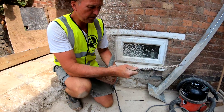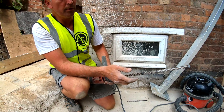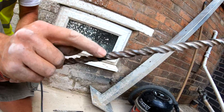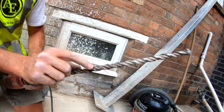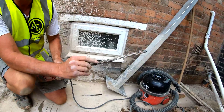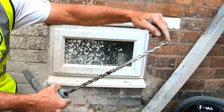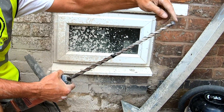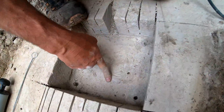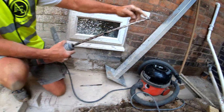The reason I'm using 14mm is because that's what's been specified by the engineer, and it matches the size of the bolt we're using. I've also put a bit of black tape on the drill — that represents the depth from the top of my footing down to the full depth I need to drill. The engineer has specified we need to be 110mm down into the concrete, so with the distance from here to where we've cut into the footing, plus the 110mm, that gives us a total of 210mm.